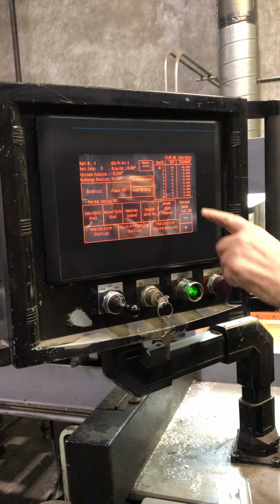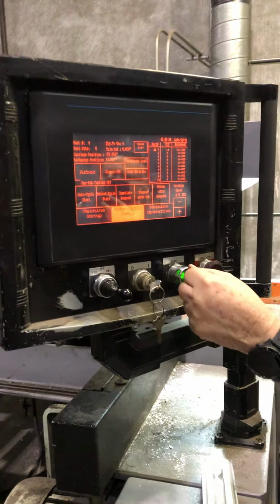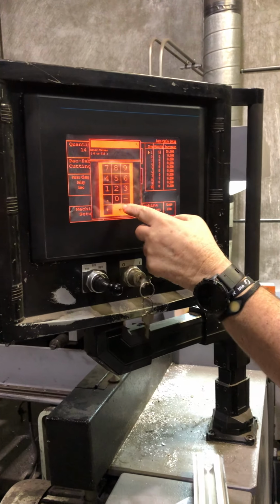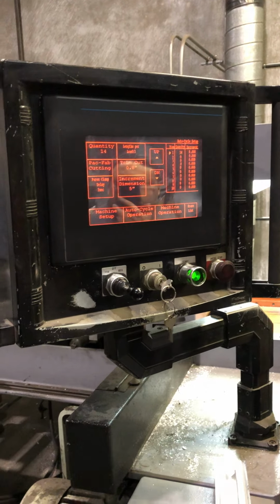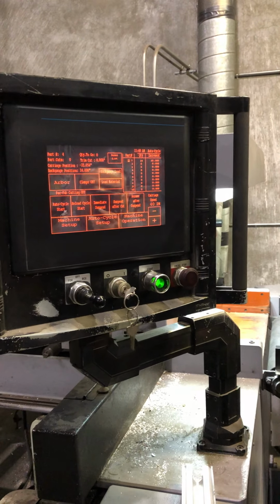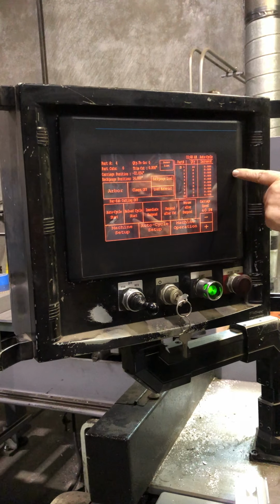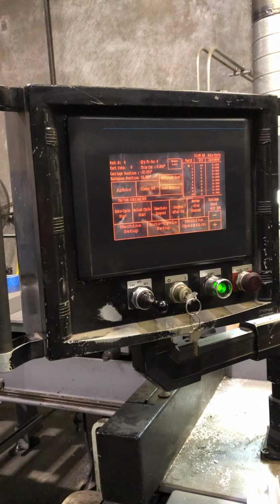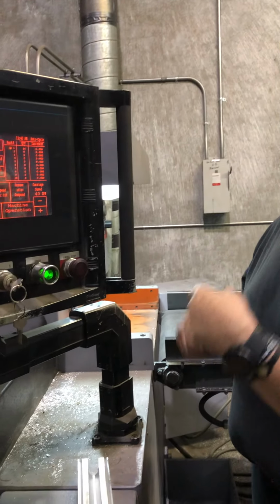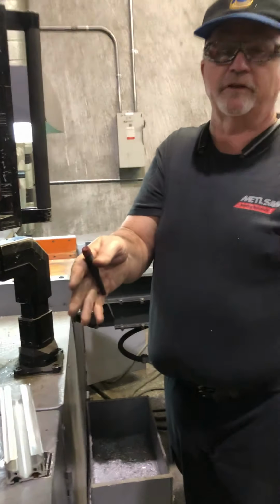So if you don't reset the list, say I go back to the setup and I change that to 5-inch increments and I go back to the auto cycle operation, it's still showing, well, it shows that. It may show it, but it's not gonna cut it. It's gonna cut it at the last thing that it's reset. The reset is letting it reread whatever it is that's in the auto cycle setup, all right?